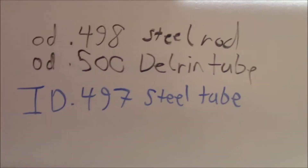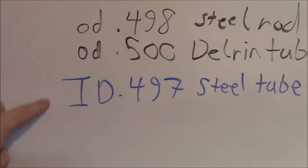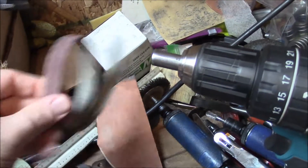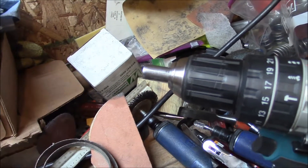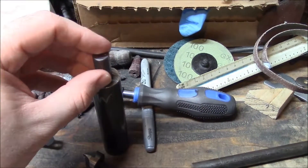Let me show you this first. These are the dimensions of the parts I have. These two need to fit into this one, and as you can see they're a little big for that. To make those work, I'm going to turn them down on my drill with a piece of sandpaper — kind of like a lathe. That piece was too short; it didn't have enough stick out, so I'll turn it down and then cut it to the final size. When I get it turned down, I'm going to slide it in here and use it as a cap and weld it on there.